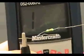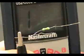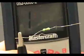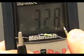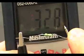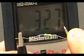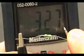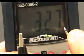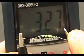Now we're going to check out this resistor — it was given to me because it's really hard to read the colors. What happens if you get a resistor and it's really hard to read the colors? You just go like this and check it on your ohmmeter. What does it say? 328. It happens to be a 330 ohm resistor — it's almost there. That would be considered very high tolerance, often referred to as gold, because gold is plus or minus 5% and silver is plus or minus 10%. So it's really quite a good quality resistor.